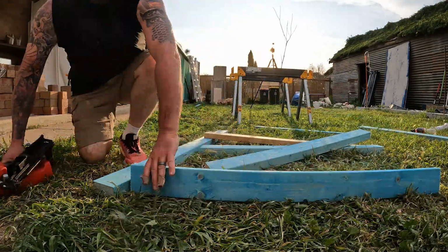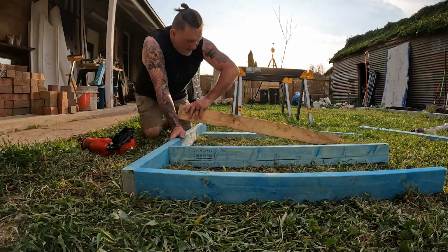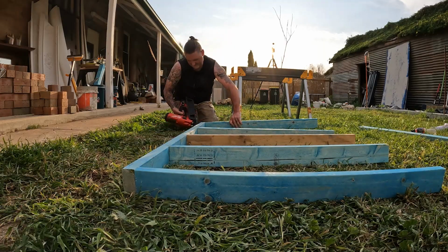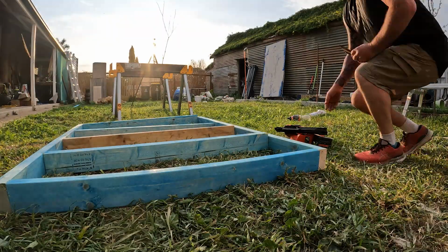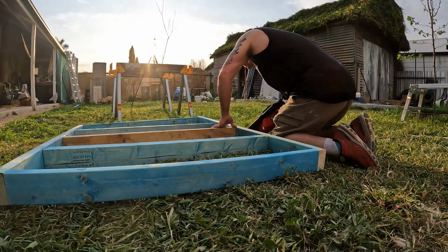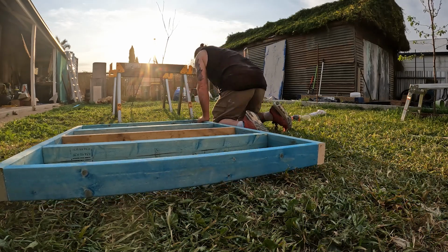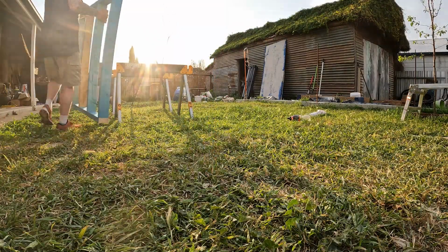So now to make up a frame for where the panel's going in between the piers. For the frame I went and got some treated pine, and I'm using galvanised nails. What I did was I put one nail in these studs just to hold them in place, and then I came back and I put a galvanised bugle head bolt top and bottom to give it strength.